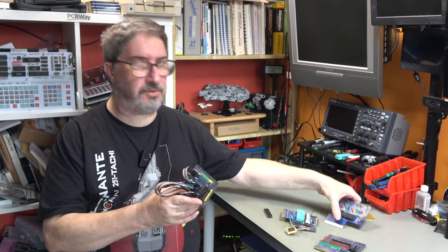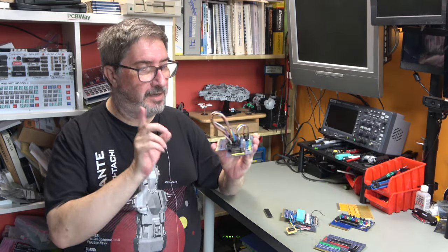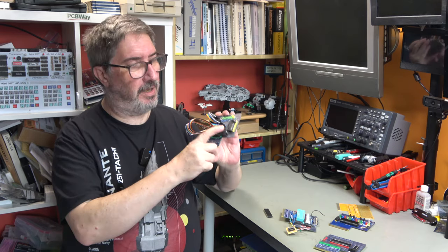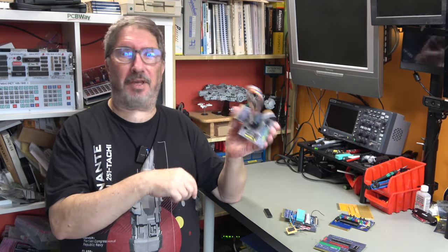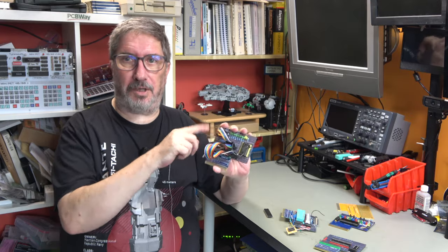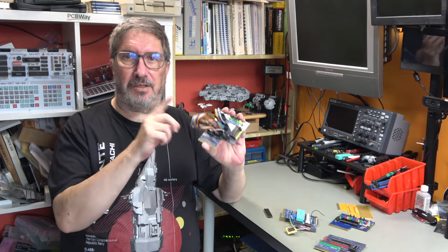I tried another board with a 6526. That's this one. And that didn't work either. I did try putting just a 2K static RAM on it. And you can see that's here. And that did work. It did prove one thing. It proved that the interface did work. And I knew that data things were going to data things and address things were going to address things. IO things were going to IO things.